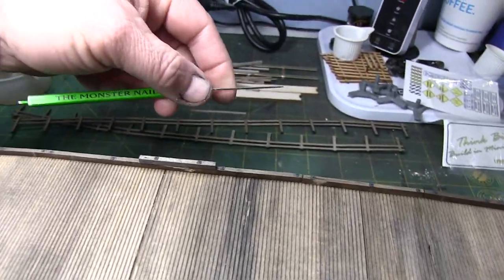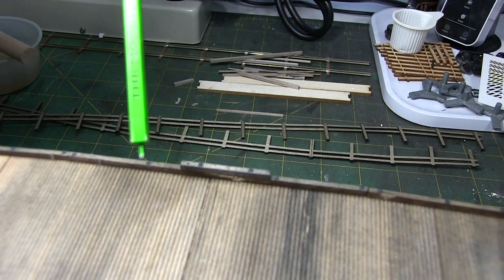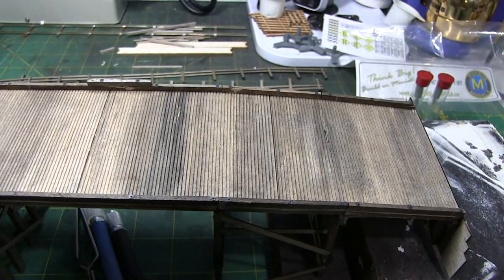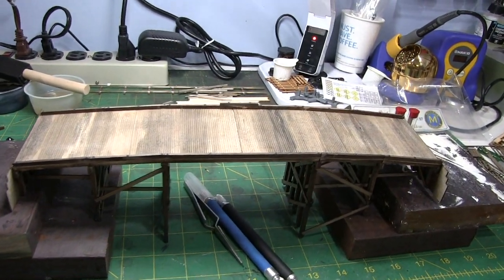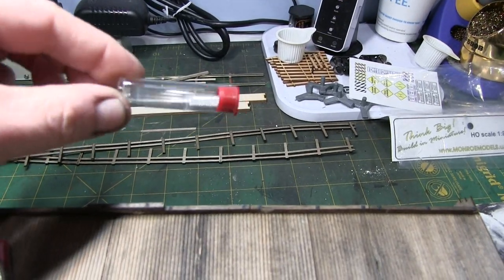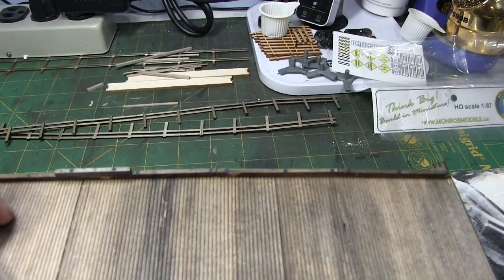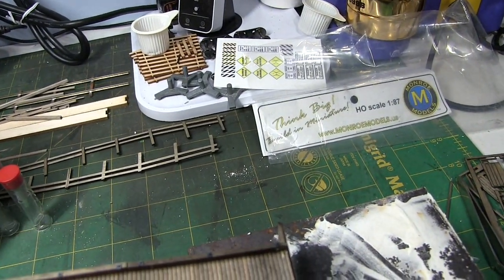For the screw holes I used this little thing - the Monster Nailer from Monster Model Works. It's got a small end and basically simulates two nail heads close together. I use that on the insides where you might see it - actually you're not going to see it unless I take detailed photographs of the layout. For drilling the little holes I used number 70, 78, and 74 handheld twist drills. I think I bought them from Micro Mark - a little expensive but really handy. I always lose little drills when they're flinging around the workbench, but these are all together nicely.